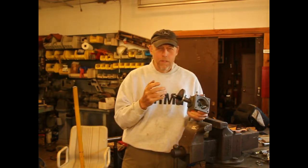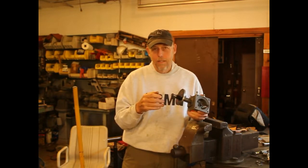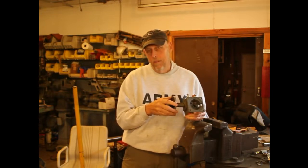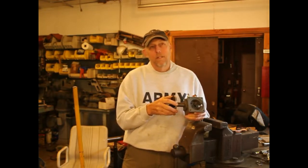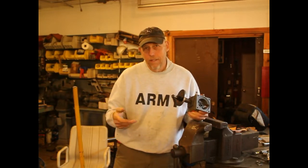I'm striving for about 10 to 25 or maybe 30 revolutions per minute, so it'll sharpen — depending on where you set the speed control — between 10 to 25 teeth a minute. And if you do the math, the blade I have is 13 foot 2 inches long, so you can figure out how long it'll take to go around the whole thing.